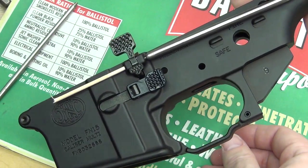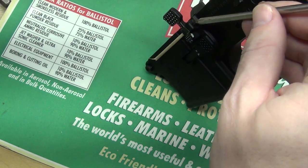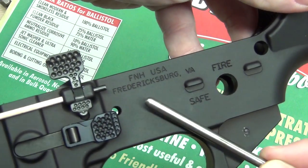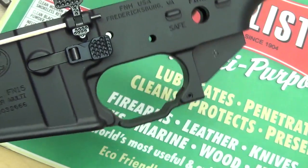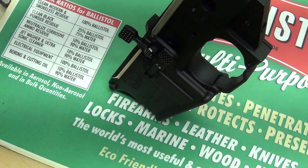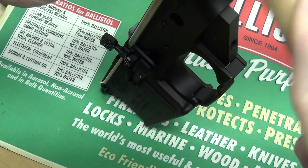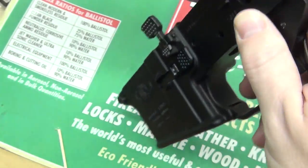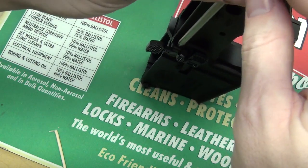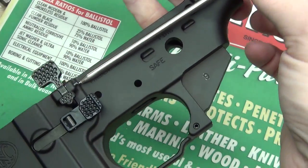You're just going to want to go until you're close enough where you can switch tools, because since the roll pin goes inside of this, you don't want to get to a point where you're going to end up mashing this tool into that. We're almost installed but you want to make sure it comes even on both holes. On this side I use my finger to help keep it straight and also keep it from banging or rubbing against the receiver.